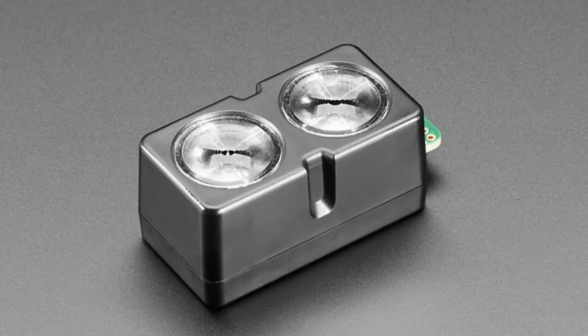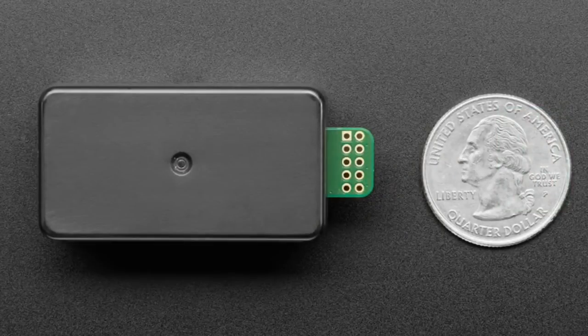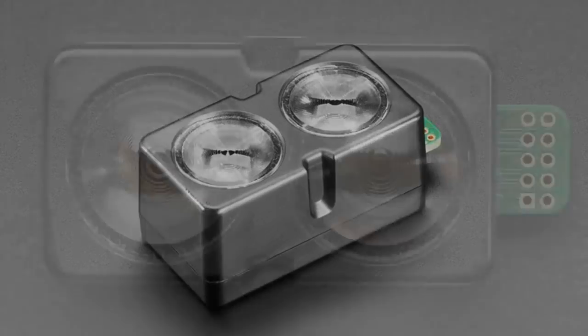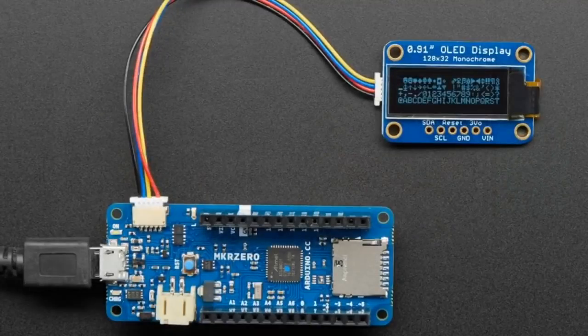What's interesting about this is it has an NRF52840 inside of it, and it exposes the SWD pins. So you can actually reprogram the chip inside, say with Arduino, or you could probably try to figure out how to do it with CircuitPython, but note that the USB pins are not exposed. You can do Bluetooth LE type stuff with it for advanced development with the Nordic chipset, reading data from the sensor and transmitting it wirelessly. For most people, they'll just use the I2C interface. There are about 10 pins: power, ground, I2C, some GPIO pins, and SWD reprogramming and debug.